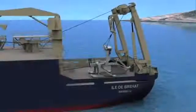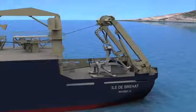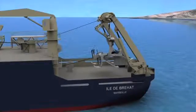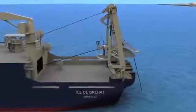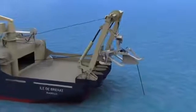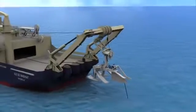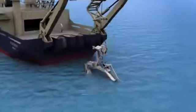The armoured fibre-optical cable is loaded into the 30-ton sea plough, which is overboarded, simultaneously controlling the cable, tow wire and umbilical tensions. The umbilical transfers the control commands and burial information to and from the plough control on the vessel to the plough on the seabed. Once through the splash zone, the plough is landed on the seabed and the required ploughing catenary is established.